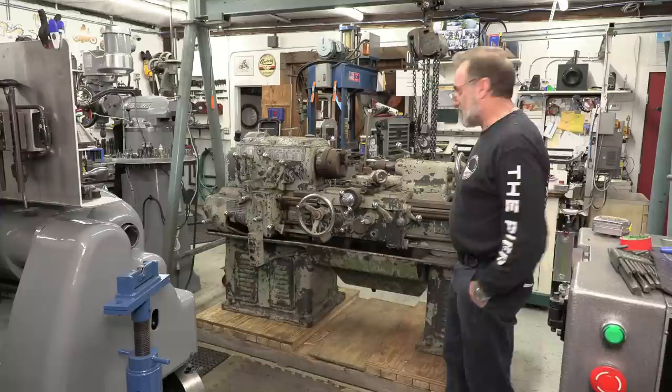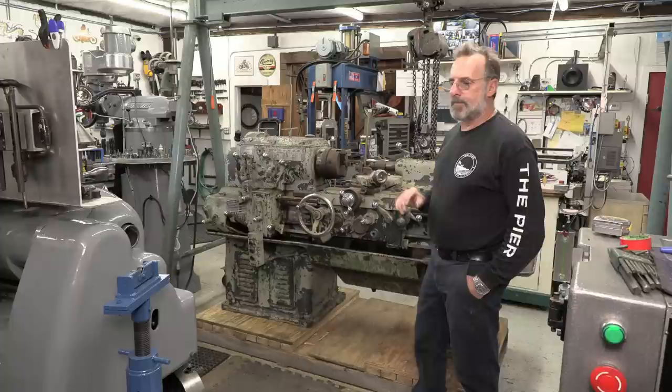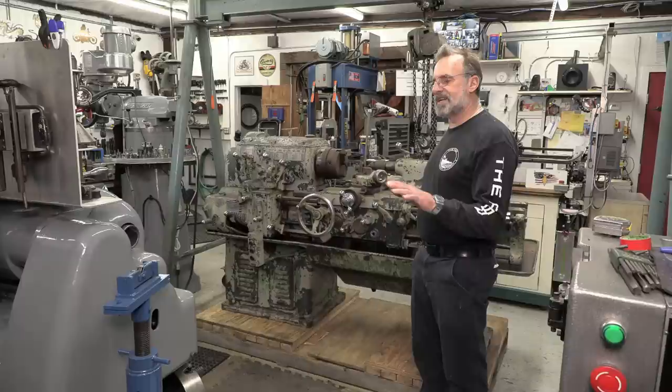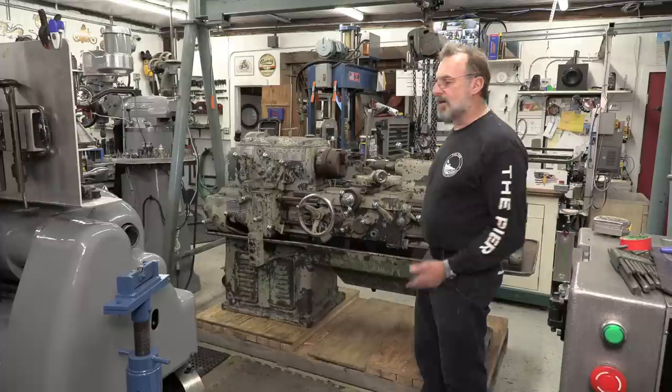Besides maybe closing up shop here. We had a little bit of downtime the last couple of days. The control switch, the pressure switch on my air compressor went out, so I kind of played around. That took a couple of days there. Not that it slowed down its function. I just had to come over and turn the switch on and off. Not that it wouldn't shut off. It would shut off, but it would bleed air. So when I really wasn't using air, I shut it off, so I didn't want it to just keep cycling.